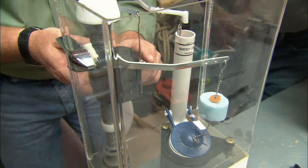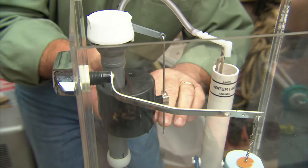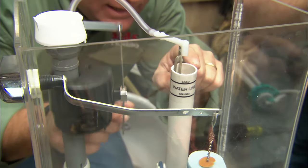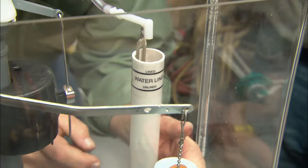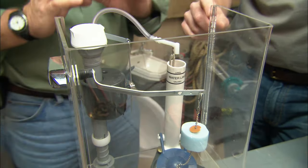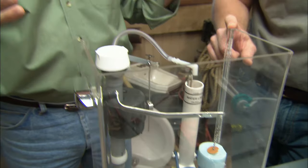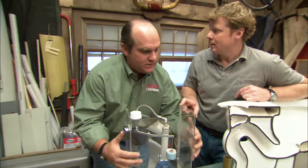The other thing is that the fill valve could be worn or misadjusted. If it were adjusted so that the water level went so high that it went right up and over the height of this overflow tube, the water would keep running down into the bowl because the overflow tube bypasses the flapper. That's actually not a bad thing — without it, water would come up out of the tank and onto the floor. But if you have that condition, be warned: sometimes it can lead to what looks like a leak on the outside of the tank. It's actually condensation forming on the outside because cold water is constantly coming into the tank, especially on a hot, muggy day.